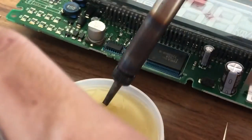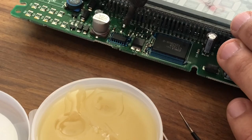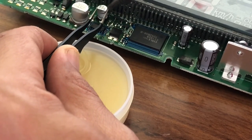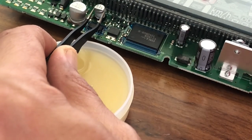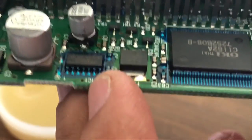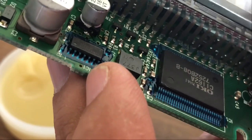I'm applying a little bit of solder and melting it onto the two spots. Then I'm taking the new capacitor and holding it with tweezers onto the two locations to solder it to the board. This part was a little tricky and took some time — just need a little patience. The hard part was getting it to line up correctly, so take your time and make sure the two pads are lined up right. This is the final product after it's soldered.